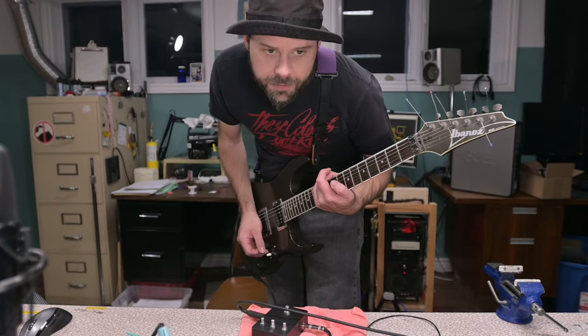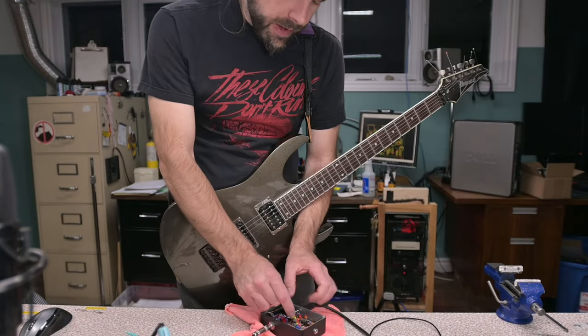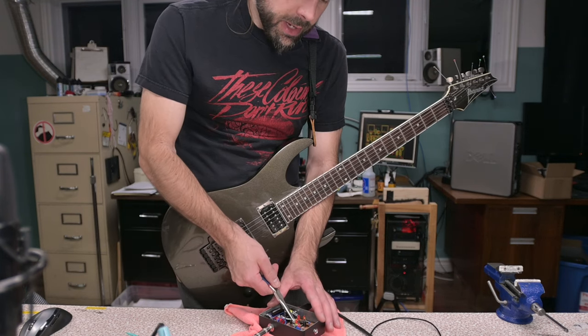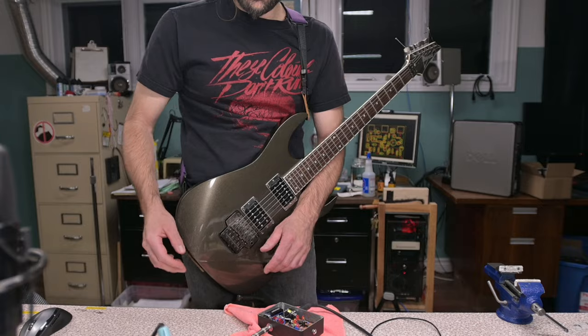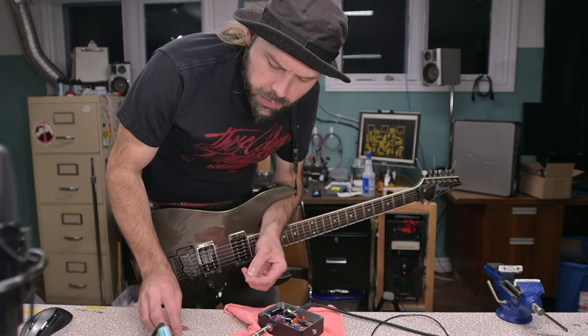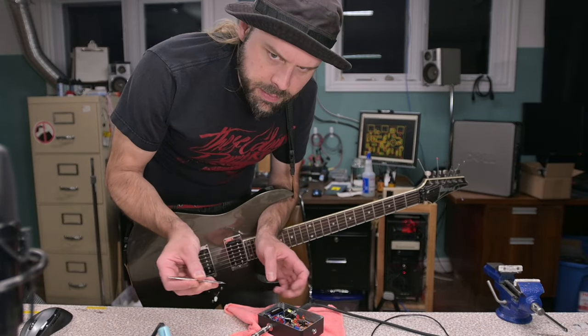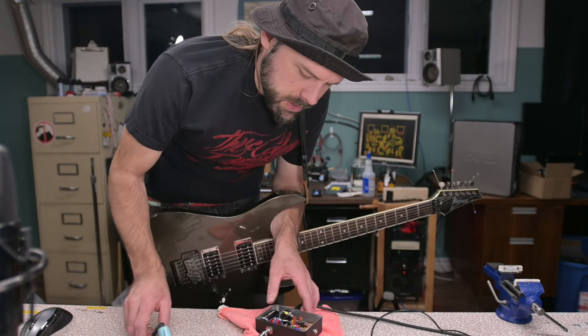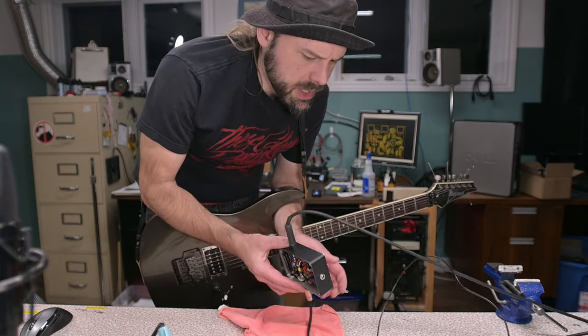Not as profound an effect as I was hoping. There's one other thing I can try, and that is I have this input capacitor 022. Pull that out and replace it with a 0.01. We'll go half the value, and the capacitor I have quickly accessible in stock is a Murata MLCC. That's okay. I think the Murata MLCCs actually sound good.